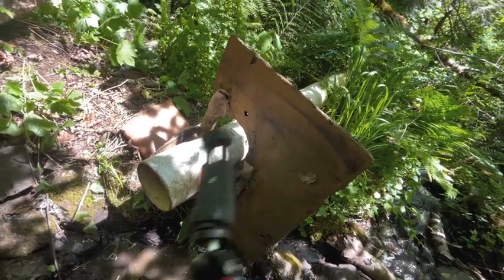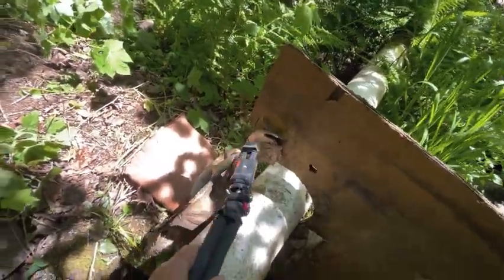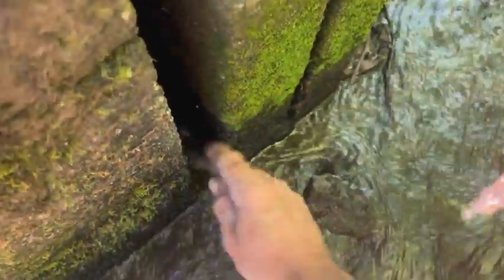You can see around my pipe I have a piece of plywood that I'm going to slide into this groove that I have in the cinder block. I came down here and poured a footing on one side while the creek flowed over on the other side, then made the creek flow back and poured another footing, and built the cinder block wall with a slot in it to drop the board in. The board doesn't fit super tight — I don't want it to because it's hard to get in and out. You can see some styrofoam I had stapled on here around the edges, but I don't mind if the creek keeps flowing through some because I only want to take a small portion of the creek water anyway. Every year when this is out, these grooves fill up with sediment, and it usually takes grabbing a stick to clean the groove out so the plywood will fit in it.